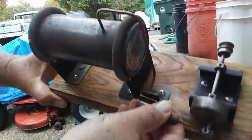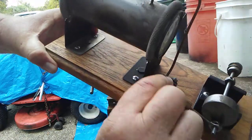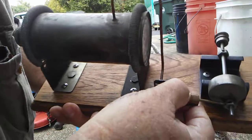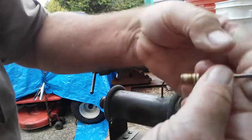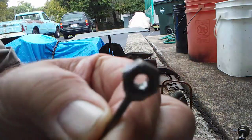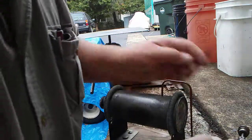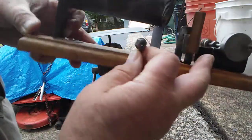I'm going to show you here — you can pull the cylinder out. I spring loaded the valve plate where it coasts on that plate with the two holes. Jammed a couple nuts together. You can pull that out with the piston, all the way out. You can take the piston out — you can see it's just a chunk of brass, soldered to a chunk of brass, soldered to a 5/16th nut that is drilled out with an oil hole, filled with solder. One time I was showing off and put so much air in it — ran it on the air hose — that I blew the eyelet off the end of the rod.